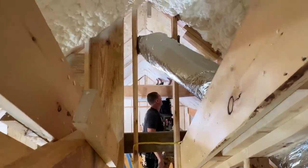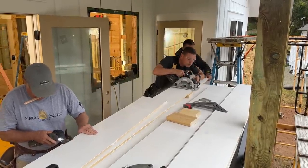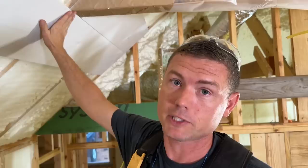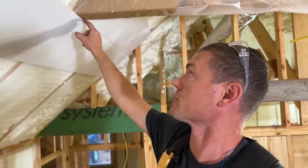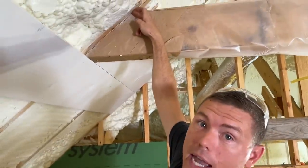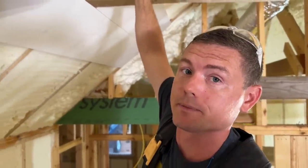Okay, it's all you. We did a lot of thinking about where to place our first full row to make it easy for ourselves and to make it not have a skinny rip at the top or the bottom. That doesn't look as good. No, so it's a lot of factors and you can't always have everything that you want. We decided this is the best place to start. We're using our beams as a registration point because we were very careful to get the layout of these beams as perfect as possible. And this gives us a really easy way to start with a straight line at the bottom. We're gonna fill in and that'll take up almost the entire depth of the angle of the beam. And then we'll have a tiny little notch at the top. So to me, that makes it a lot easier.